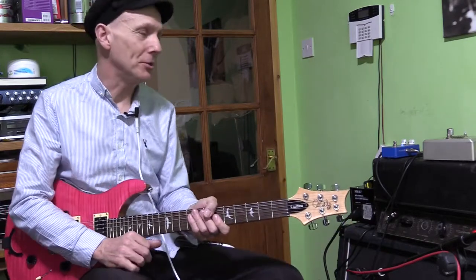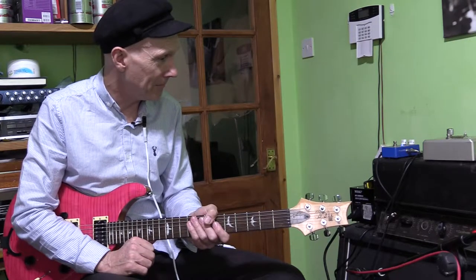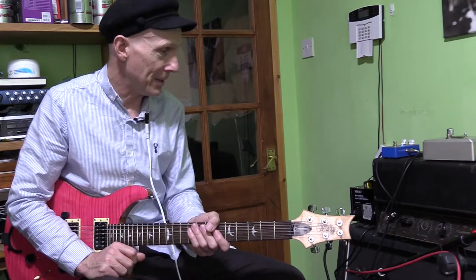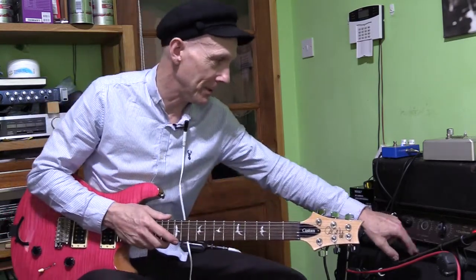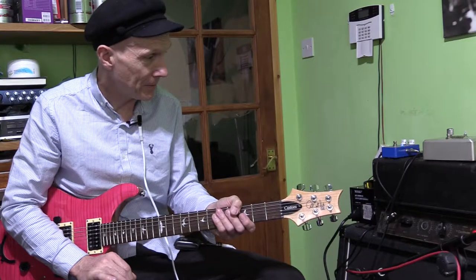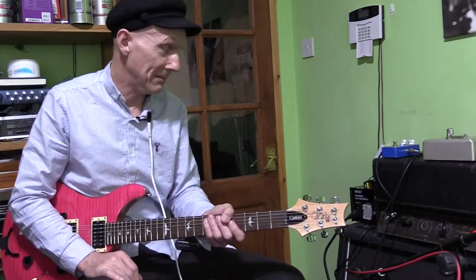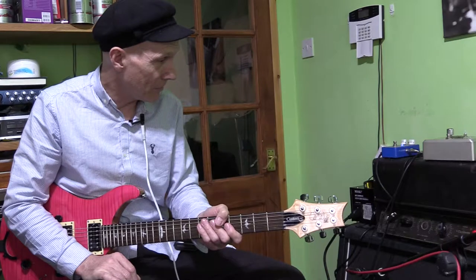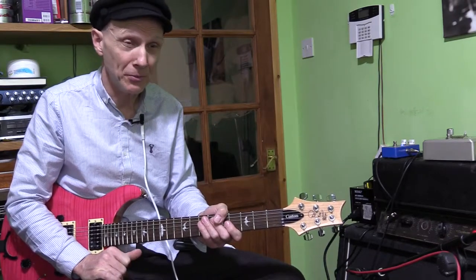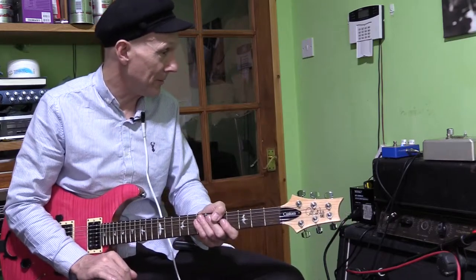So I'm mulling over various mods to go into this amp. Probably three or four mods. I'm mulling over whether to add some kind of tone stack into it, because it really doesn't have one. As we know, the tone's running off the plates of the output valves. Very strange way they've done that. So there's really no signal loss, which is why this amp's incredibly loud. So if we put a tone stack in it, we will get an improved, well, more variable tone, but it won't be as loud, because you get loss obviously when you put tone stacks in there.